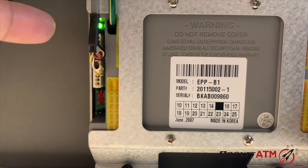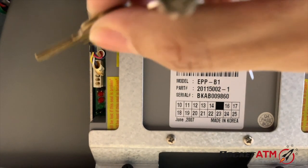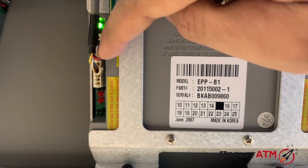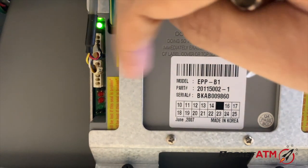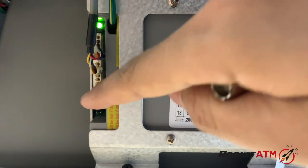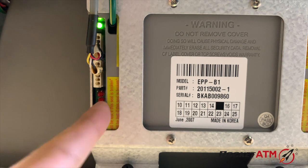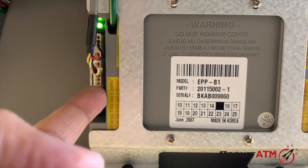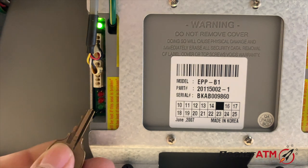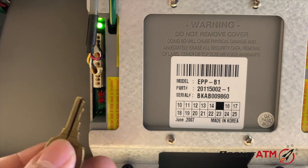What we're trying to do is detect the two connectors. This is a process that requires you to kind of twist your body a little bit, but as you can see there are two major connectors powering this keypad. There's a small connector with about four slots in it, or two wires going in it, and then the bigger one with about six slots in it. We're looking for the two jumper pins located underneath the big connector. You can see there are two little pins right here coming out of this keypad, and all we're really doing is grabbing a metallic object — I'm just using a key — and with my key I'm going to tap both of those jumper pins.